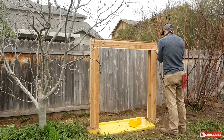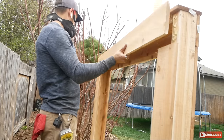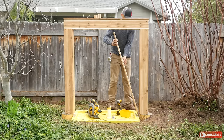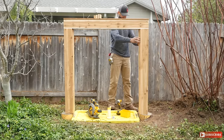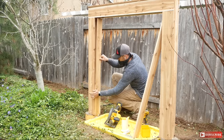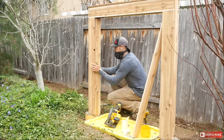This part will be the housing for all the hoses and the sprayers of the water feature. The second piece of advice I'll give you guys is making sure that you have two access panels on the sides of the faux beams. The way I secured those is with no wood glue, just screws — three sets of two screws running top, middle, and bottom. That way at any point in time if I have any water feature problems I can simply pop those open and fix whatever the problem is.